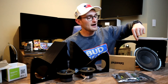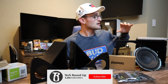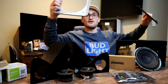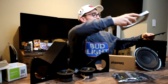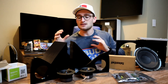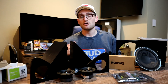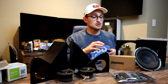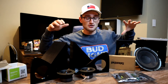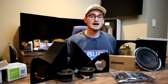Starting off, I pulled out a six inch sub from my old gaming sound system, and that allowed us to use this 30 watt sub along with the face plates and the little mesh front. That'll give it a really nice clean look. We also have two four inch Dayton Audio full range drivers — the RS100-4s — to power all of the electronics. We have a Bluetooth 5.0 2.1 channel amp that I got on Parts Express.